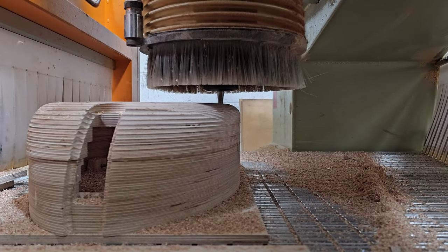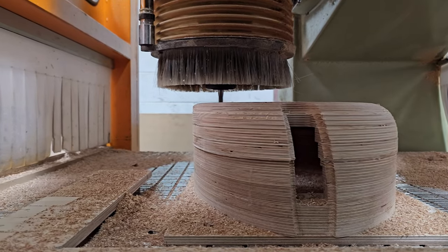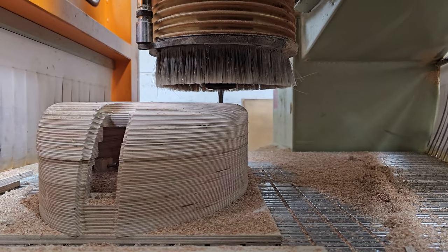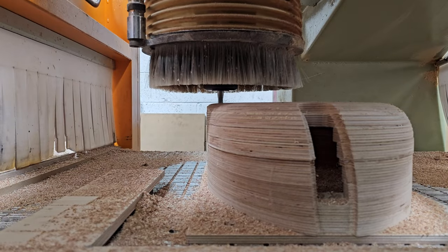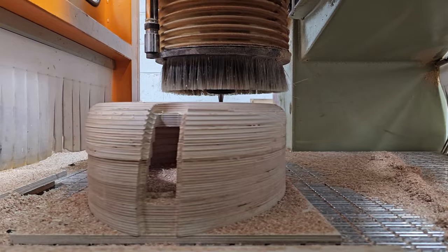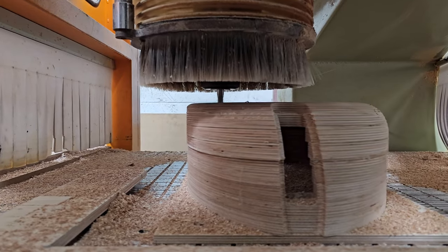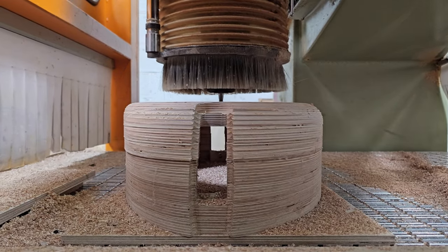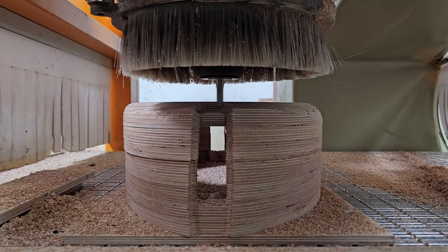After cutting through the first two nails, I'd absolutely destroyed this cutter. You should see the state of it. I didn't think it would keep cutting, but it's the only one of these I had in at the moment, and I thought I'd just keep going. So I thought, gentle, just a couple of passes, just a little bit of material at a time. It turns out it actually left a surprisingly good finish, considering the state that it was in. Even the floor finish on the bottom of the pocket was quite good. The only problem was it had chipped off the sharp corners, so there were no sharp internal corners. So we'll see in a minute or two. I need to come back in and finish it.